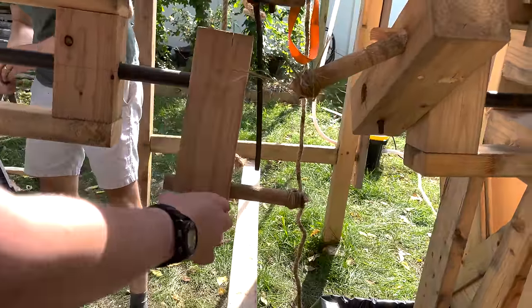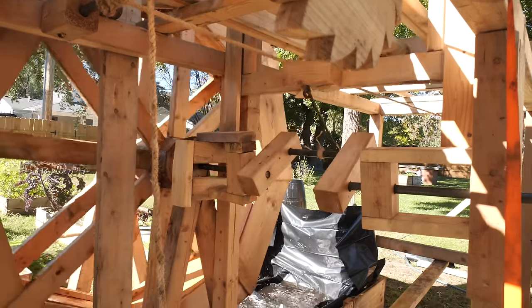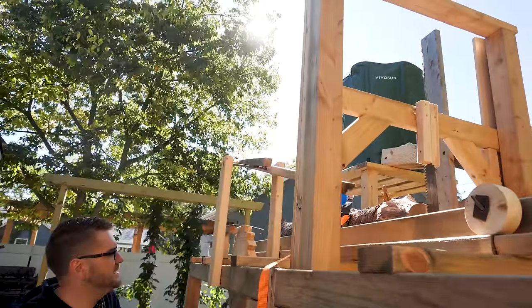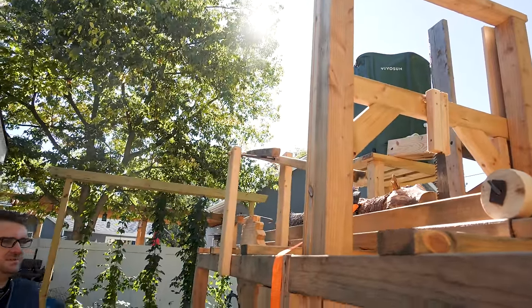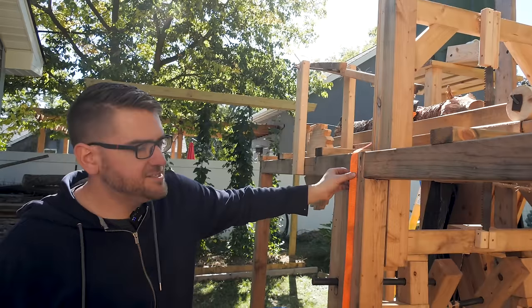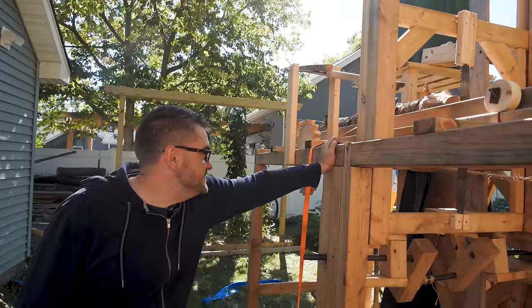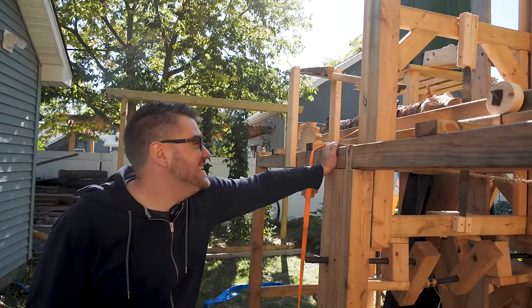We had this middle joint here, a middle bar that broke. Previously it was made out of wood, so that's now metal. A few of the joints here are redone in metal. And we thickened up some of the wheels so it stays on the track a little bit better. And we just have a ratchet on here for now. Eventually we want to figure out the dog system for holding it in. Just for testing purposes, we have the ratchet on there so we can get in nice and tight.